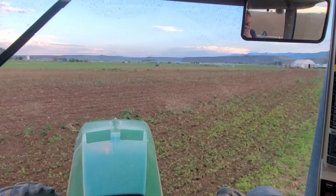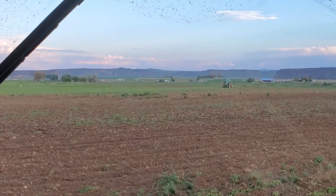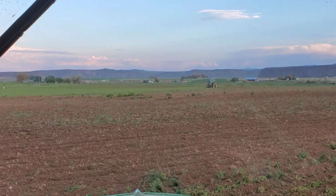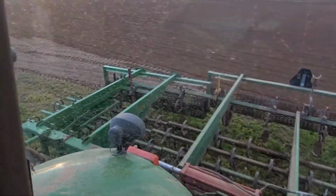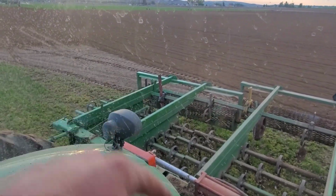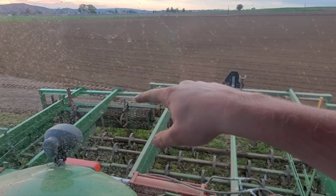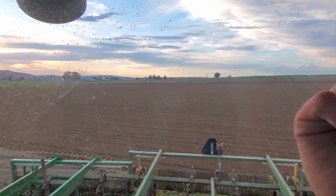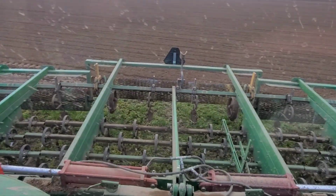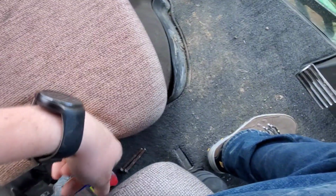So, my uncle was chisel plowing this pivot here. There's a tractor down over there, but he had to go irrigate, so he quit. So anyways, gotta go out, put a couple bolts, one over there and one over there, to keep these side baskets from flying up or, I guess, in and hitting stuff when they're folded up. So I just have to go put the bolts in, and then push them down there.